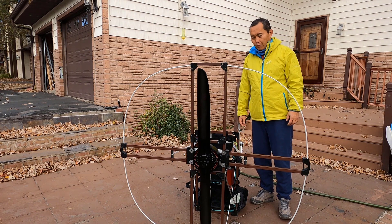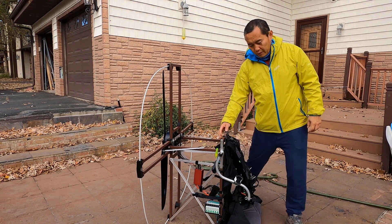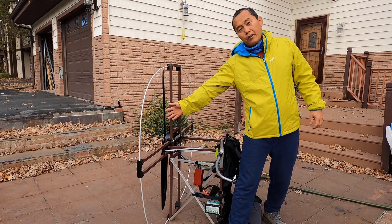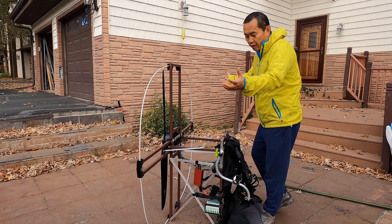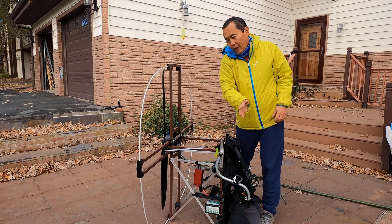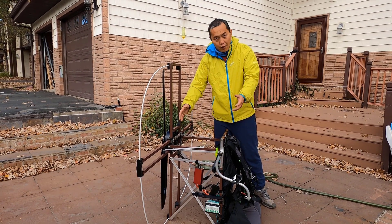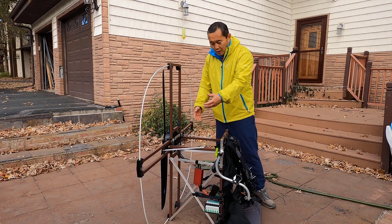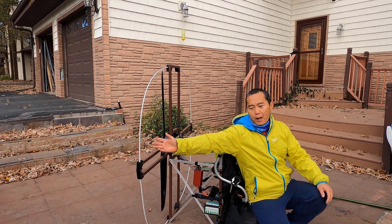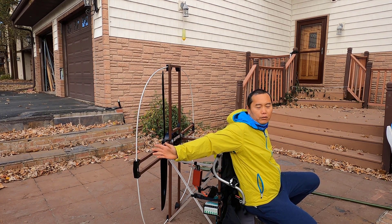The thing is, I extended the motor, so basically if the unit is on your back, your hand cannot really reach the propeller — so that's the built-in safety. In this way I don't need to put a net. Basically the net prevents you from accidentally putting your hand in, so I extended the distance. Not only does that increase air efficiency, it also keeps you safe — your hand cannot really reach back to the propeller.